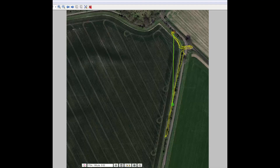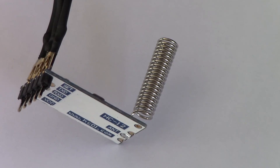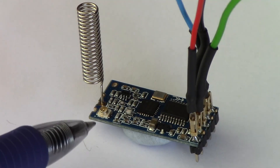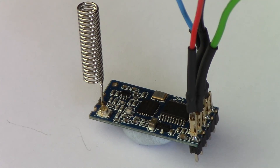The overall result is that we had reliable transmission over a straight-line distance of 170 meters, which is not particularly impressive but it's what I got using this 10 milliwatt power level in these circumstances. I'm not a great RF expert, but I presume that this is a helical antenna operating in normal mode — presumably we could get a better antenna, which might give greater range. There is a U.FL socket to which we could plug an external antenna if that was a good idea, or we could operate at 458 MHz where we're allowed to emit 100 milliwatts rather than just 10 milliwatts, and that obviously would make some difference.